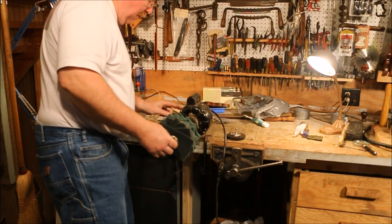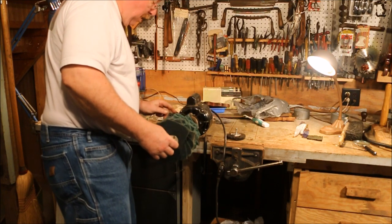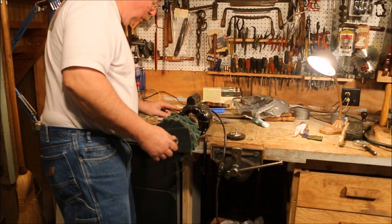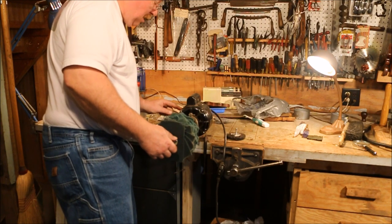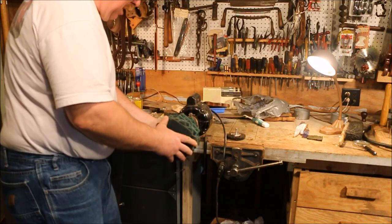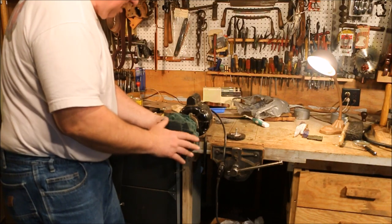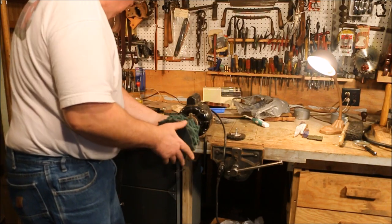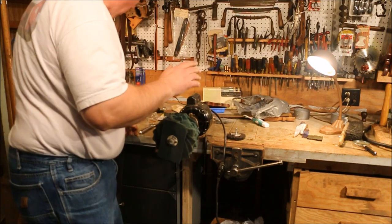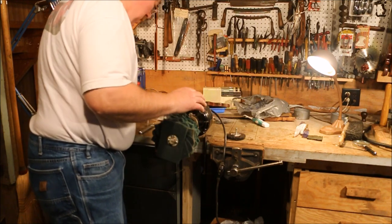Made by the Dayton Electric Manufacturing Company, Chicago, Illinois. And it's a model KS60MM1139 type KS. Quarter horsepower, 1725 RPMs. Now I might find that it's better to put a speed reducer on it, in which case I have a resistor that I'll put in line and we'll see what that does. But right now, I'm just gonna try it and see what happens.